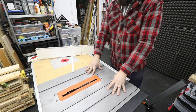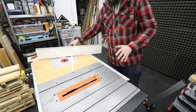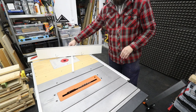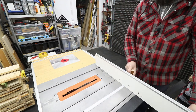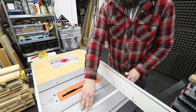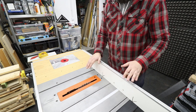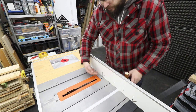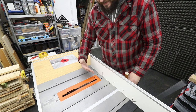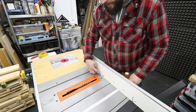On the tabletop of your saw, you'll have some mitre slots — always two, one on each side of the blade. With cheap saws the mitre gauge is often quite poor, so I made my own. The fence on mine is a lot larger and I have no play with the plastic runner I've installed. With the old one, the play in the mitre slot was absolutely horrendous and you could not make an accurate cut. Now I've got zero clearance for both straight cuts and 45 degrees, which allows me to have very good results on cross cuts, especially on plywood.